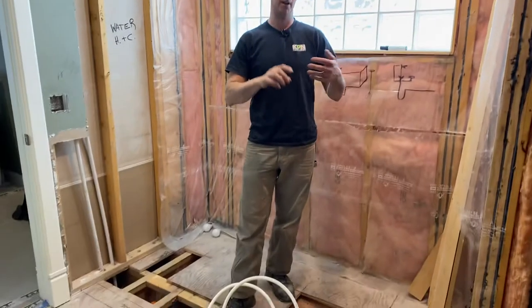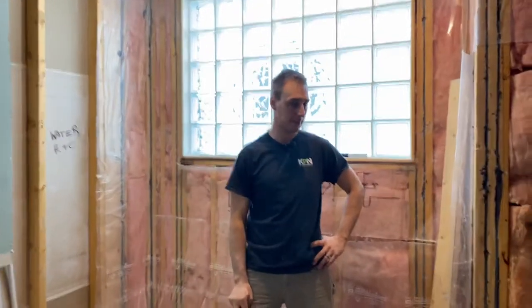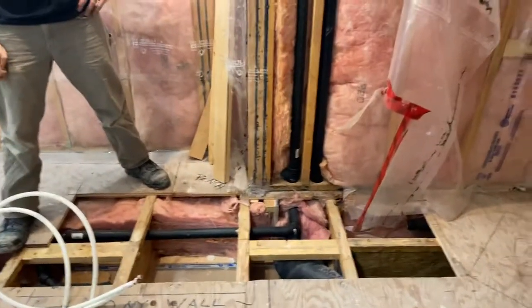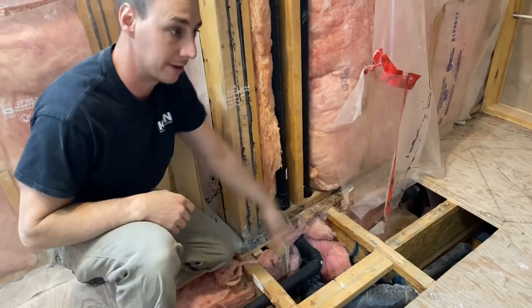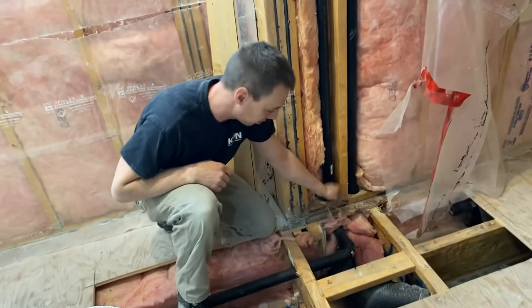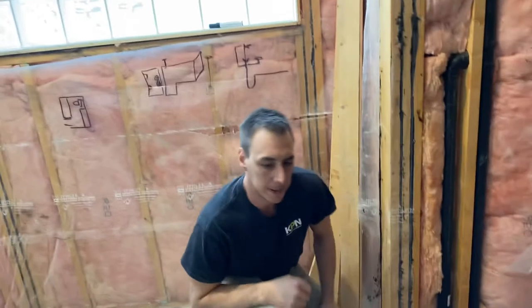He asked us to stub it over here and he'll put it in himself. They're very good — they usually do their own valves and water lines, but on this one they couldn't pull a permit, so they asked us to come in. We just do their drainage because we know the code and can pull permits — that's all our inspectors care about. Also, that vent was 90'd out of the wall and under the toe kick of a cabinet, then down. Since it's no longer a cabinet and it's open to the space, we just drilled a hole and brought it up in the wall, which saves them from having to box it out.